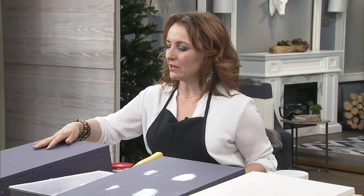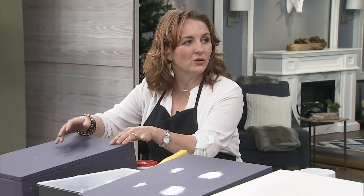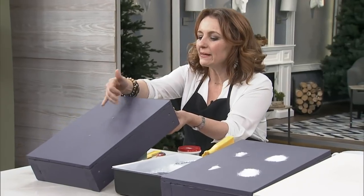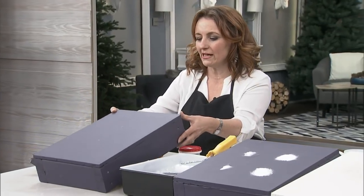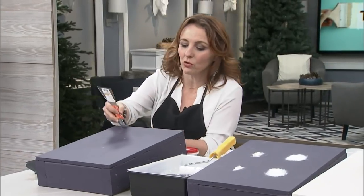I've got two here because behind all of my pictures there's at least two holes, so let's be realistic. The problem is when you take it off, especially if you've got a screw, not only do you have the hole, but it actually leaves texture — the drywall paper actually comes up. I don't know how well you can see that, but it comes up. So you've got texture, and if you don't fix it from the beginning, you're going to end up with more of a problem.